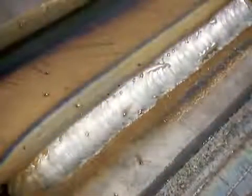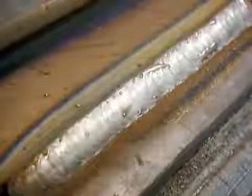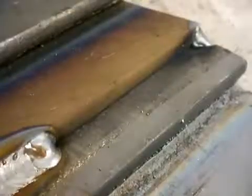Basically, it is just making a series of U's or cursive E's or small loops or whatever you want to call it. In your mind's eye, you just try to make the same distance loop every time. And on a lap joint, you watch the top of the puddle or the side of the puddle that the edge of the metal is on, and you just kind of use it for a guideline and just barely let the puddle nip that corner just a little bit. That'll give you a nice straight border on your weld and a better-looking weld, because you won't be melting all that corner in and putting extra metal into the weld size. The technique looks something like this — intentionally loop the same distance each time.